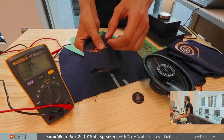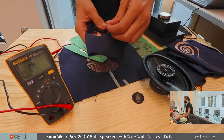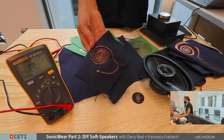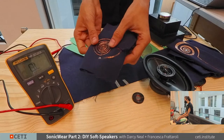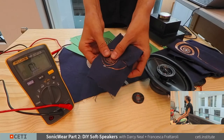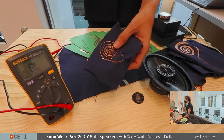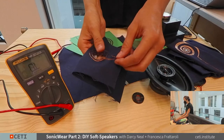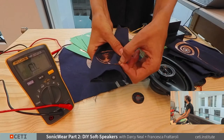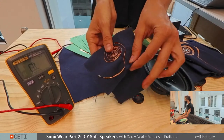So that's something to consider with your design, that if it's bare copper wire, you would probably want something stuck on top of it just to isolate it to make sure it doesn't short out whenever it folds over on itself. You can paint silicone over the top of it, can't you? Yeah, you totally could. That's an idea. And like I mentioned, they make these wires that have the special coating on it, so that way you can use it for applications like this.